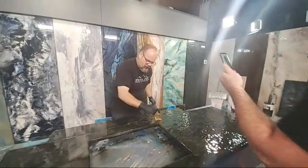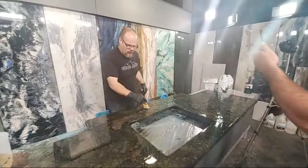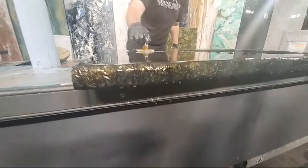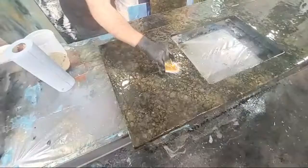On this windowsill, I'm doing the same thing — just chopping that out. Jennifer has a question: 'How long do I need to let the bonding primer dry before I put on my first coat of epoxy?' I like to let the bonding primer dry for a day. Don't be in a hurry. It also lets any ammonia out of the paint — water-based paint has some ammonia trapped. That's not a big deal with a dark countertop, but if you have white or a light-colored countertop, excess ammonia trying to escape can amber or yellow that finish. So let that dry for a day, and even put a fan in the room to blow that off the surface.